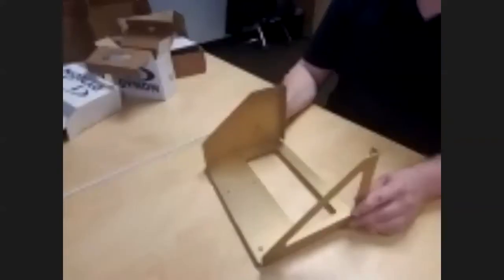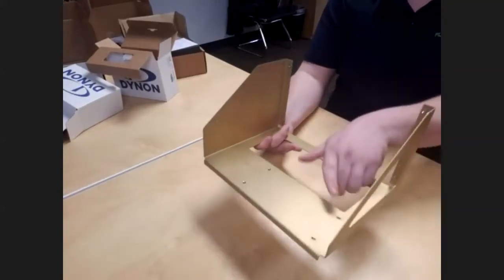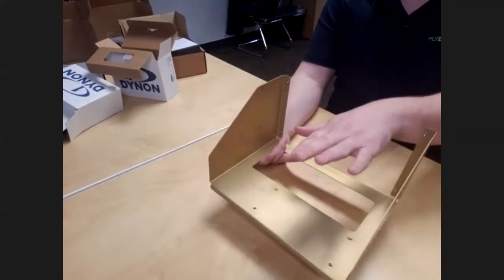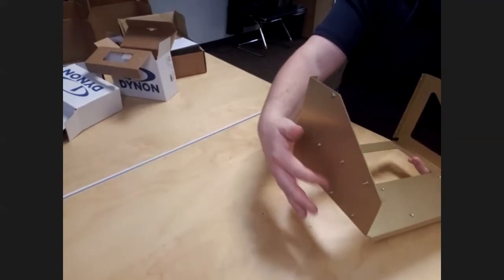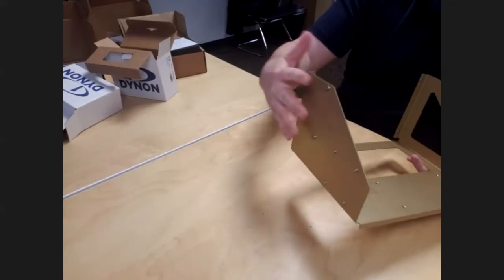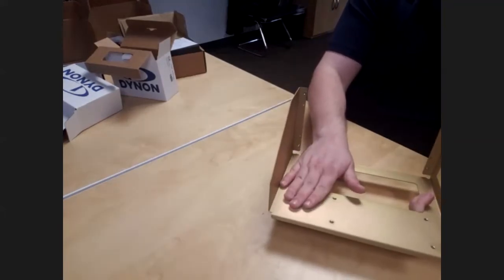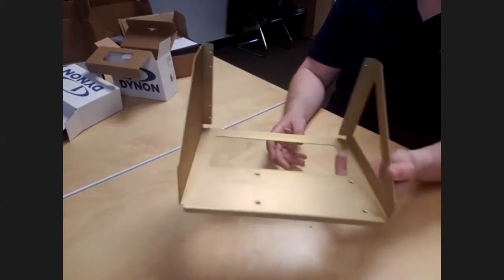So I've got one of the shelf trays that you see there already pulled out for you. You can see the four pre-threaded holes with PEM nuts already in them for the EMS module. So no drilling and tapping you have to do for that. Those three modules stacked up here. Typically an ADS-B receiver goes on these four holes. And then these two are designed to mate the backup battery perfectly. So this sits on the outside, or the inside for that matter. And there's usually enough space here for something else. You could put a transceiver there, transponder, 5-port network hub. You have a lot of flexibility in how you do that.